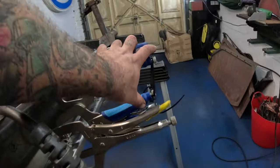After plenty of cutting, grinding, beating, welding, everything else, that's what we've ended up with. You can see it's got a bit of shape to it. That obviously fits up inside there, meets that shape nicely. And you'll notice the other thing I've done is drilled some holes all evenly spaced all the way around. The plan being, this goes up on the inside, clamped nice and tight to get it flat to this piece.